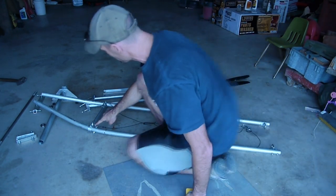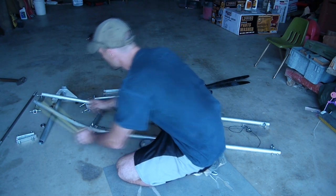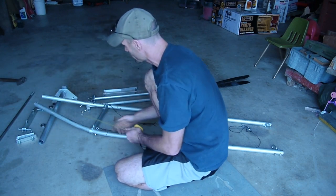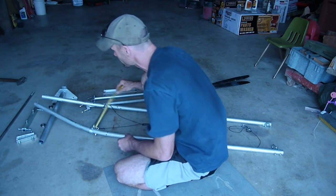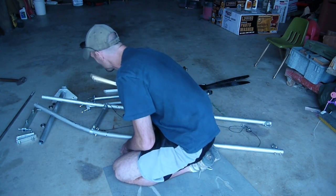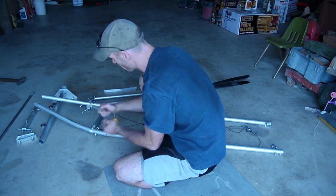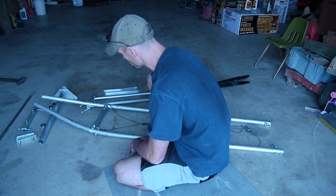This is a foot of tubing. You could probably go with this square tubing here, but I used a motor mount instead — that would be better to bolt it on. I had some round tubing left so I used it here for the motor mount. I just took these inch-wide, eighth-of-an-inch-thick pieces and bent them around to make a bracket. You can find those at any hardware store that sells aluminum.